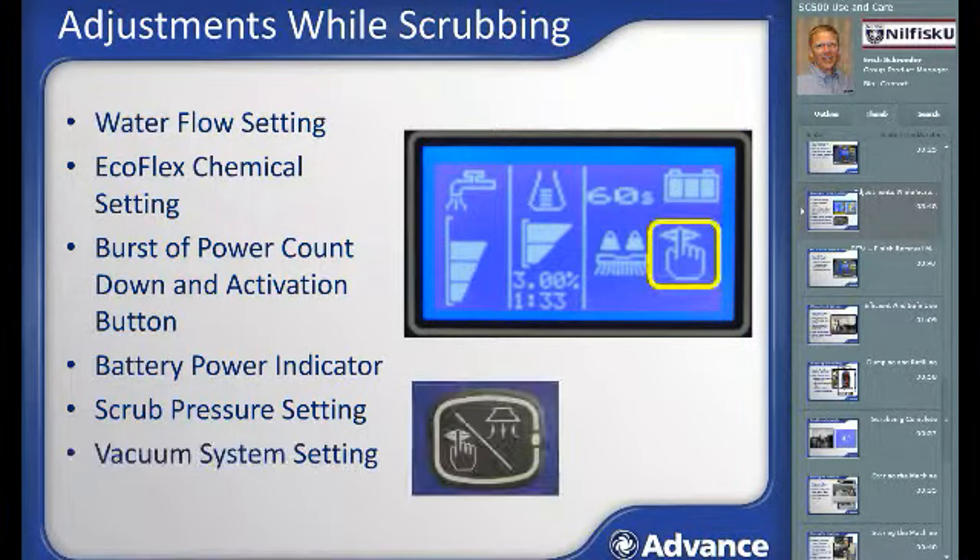The final area of the screen shows the vacuum system setting. There are three levels toggled by hitting the vacuum system button. Normal mode has the vacuum on. Quiet mode runs the vacuum motor at lower power for quieter operation. Vacuum off — where the display is blank in the vacuum indicator area — is used for double scrubbing applications. Some functionality can be locked out using the yellow superuser key, such as flow level 4 and the higher scrub pressure level. If your machine's functionality differs from what is described, it has been specifically configured to run that way.